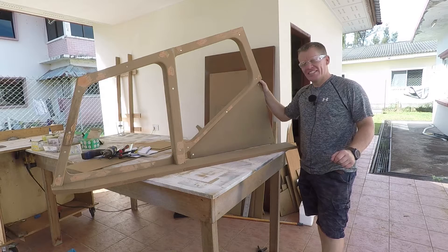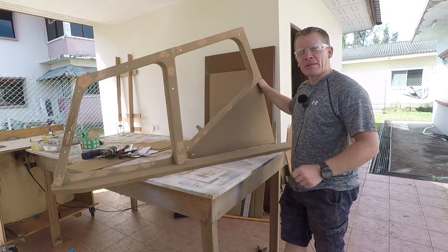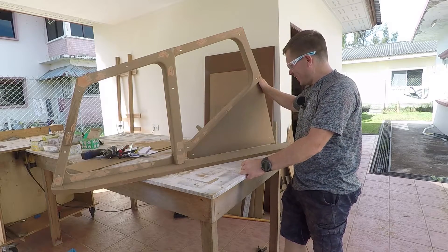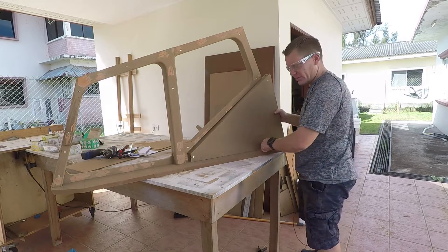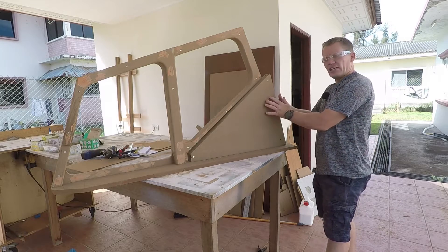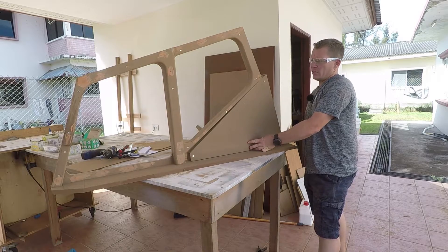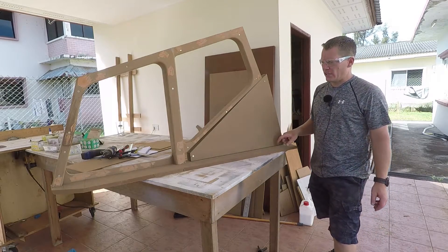While you've been gone you may have noticed I had a little costume change — a little bit cleaner as well. I made this temporary sill just to help line things up and make sure all the angles are correct in accordance with the CAD diagrams. The temporary sill is on, then I went to fit this and I realised this should have a lower sill in here that fits on — so I've not allowed for that, I'm going to have to cut a bit off. And you can also see now the angle mismatch between the two units, so the angles were definitely not right there.